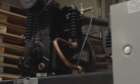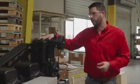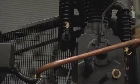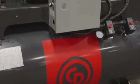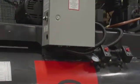You run one pump at a time when you don't need a lot of air and you're only running a few air tools here and there. But let's say you've got a sandblaster and you need to kick that on — then our other pump comes on. We have an alternator panel down here on the front of the machine, which swaps the pumps back and forth and keeps the load from being all on one pump at any given time.